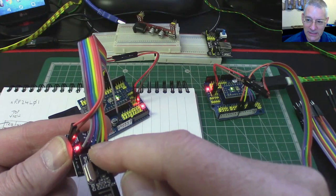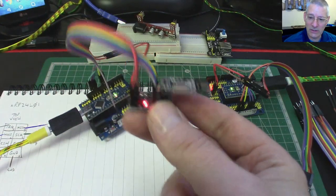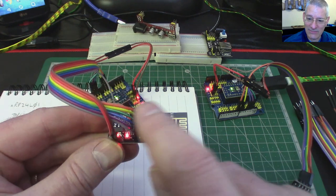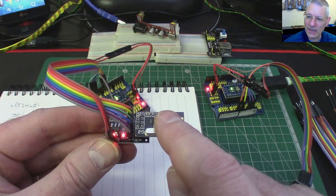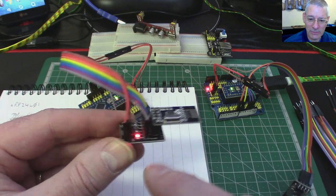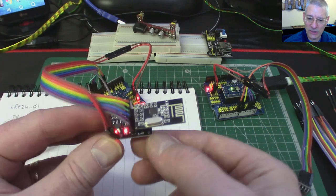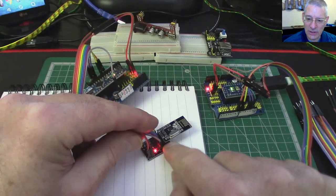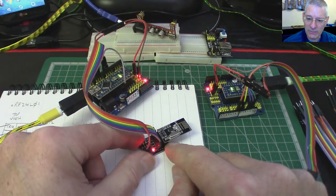I also received those adapter sockets today — you can see it's a small adapter board. It accepts 5V in rather than 3.3V, which makes it much easier for Arduino users to get the right voltage. The cable color sequence I struggled with has been honored — they haven't changed the pin order. It also has a little LED indicator light, which the bare modules don't have.